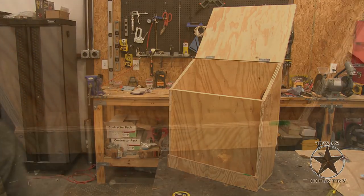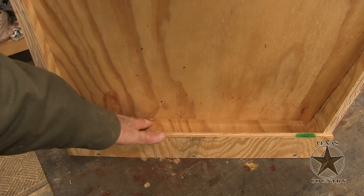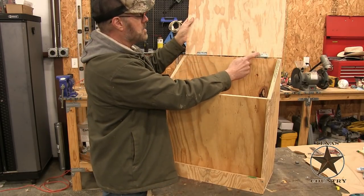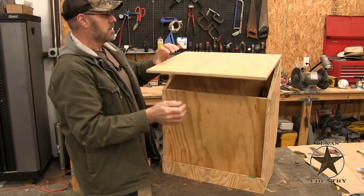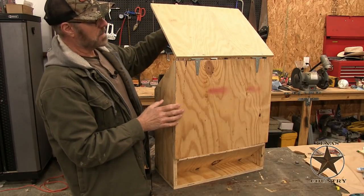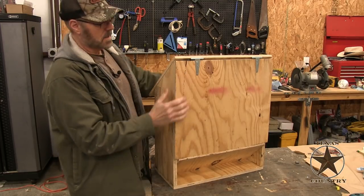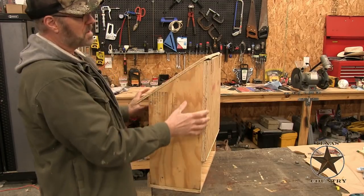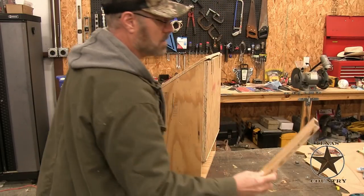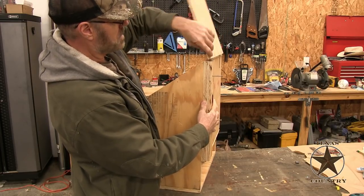Let me get you in for a close up. I have a one-inch opening under here. The hinges — I had to do something a bit different. I connected them to the inside of this board and to the back here so it can lift up like this. Now the problem is this is going up against a 2x4 stud, so when this lid opens it's going to interfere. So what I'm going to do is put this spacer piece here, and now it shouldn't interfere at all, as you can see.